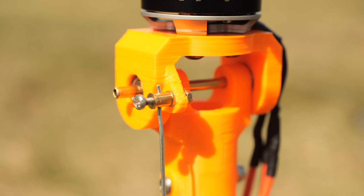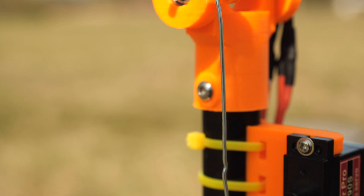The characteristic feature of the Bicopter is that both motors have to be gimbaled. More advanced models will have two degrees of freedom for each motor. However, you can sacrifice and simplify the design by having each motor gimbaled in only one degree of freedom. My Bicopter is just such a device — the top motor stabilizes roll, the bottom one stabilizes pitch, and yaw stability is obtained thanks to the differential torque.